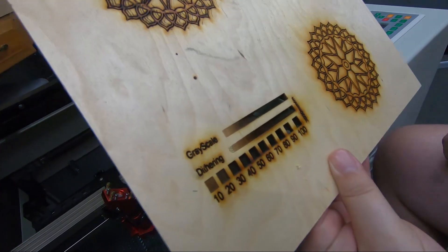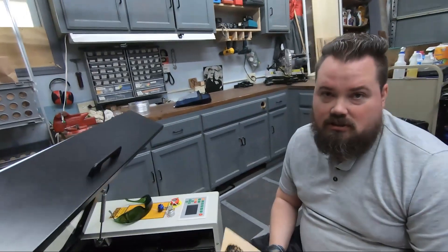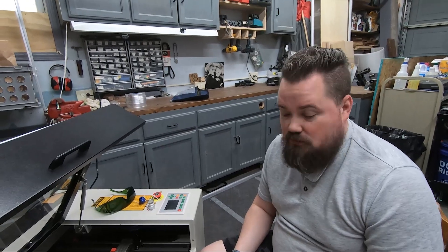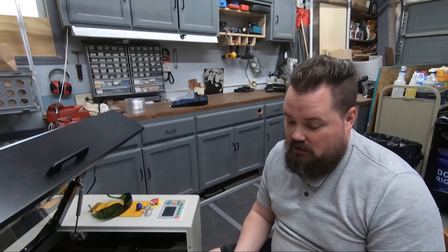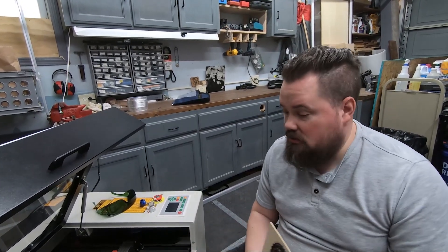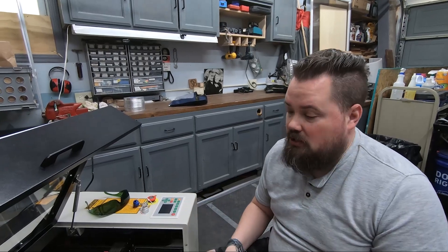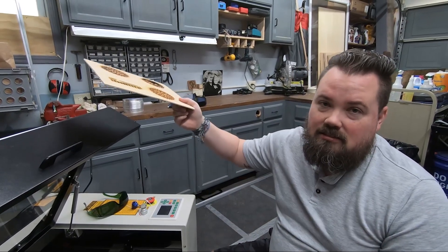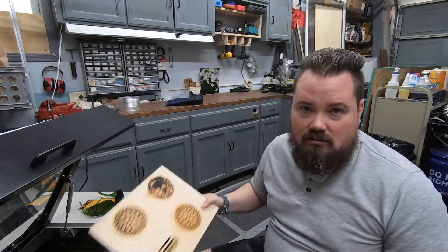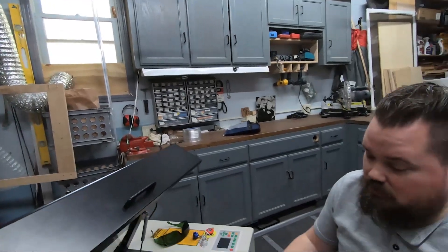It cut the numbers great. It's very very strong compared to anything we've had before, so it's going to take a little bit of redoing the power scaling to see exactly where the power needs to be for each file. But I'm super excited because it'll cut — it's moving great, that was really fast and I didn't even adjust the speed so it could go faster. The exhaust was having a little trouble keeping up since we were going clear through on everything, making a lot of dust. An inline exhaust fan helped pull it out a little more. We've got that vented to the outside because it created an absolute ton of smoke.